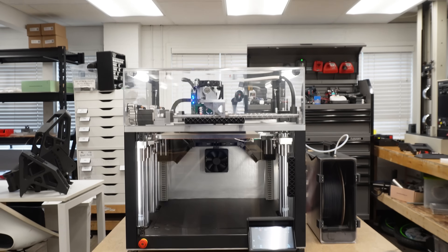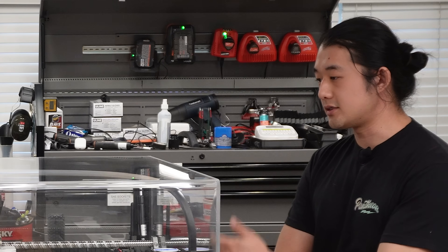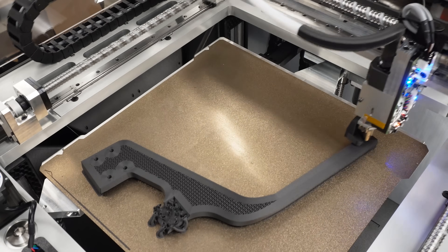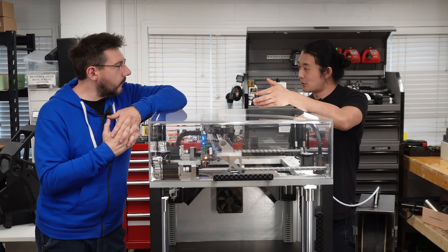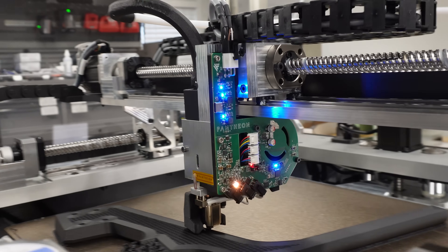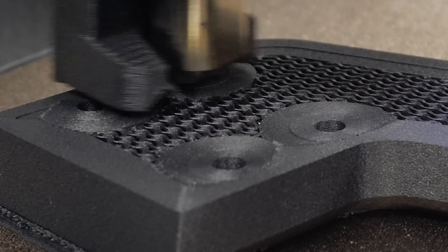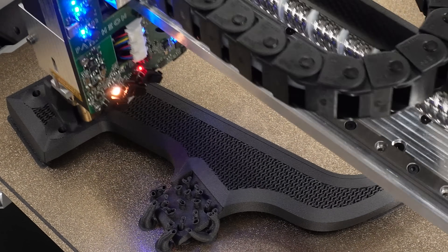So what went into making this machine to realize that? Let's start at the top with the printer. If you look at the parts, notice how dense they are — super dense, there's no air in there. A big part of strong parts is it needs to be all part and not air and voids. That was one of the big things we wanted to solve in FFF. Look at how it's almost perfectly dense. You can barely see the lines.